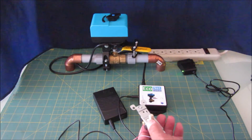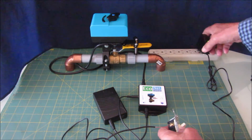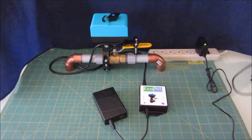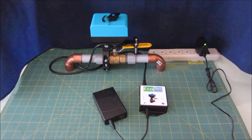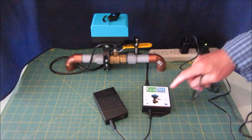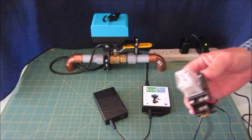Now let me add the relay I've set up to shut off the valve on power loss. We've had a number of customers ask about this — there are some good reasons to shut off your valve when you lose power. I've used the AC adapter that comes with the Bulldog to give this 12-volt relay its 12-volt power.